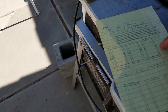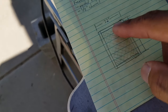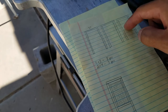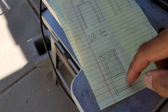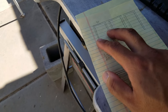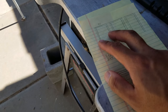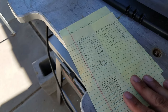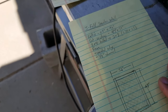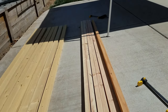Three two-by-fours will make the frames here which will encase the lattice, as you can see. Then I have the two-by-threes which will create the main frame of it, and I have it drawn out like that. As for the height, that has yet to be determined — I might go at most six feet. I never usually show you guys my sketches and notes, but this is what I normally do. So what I plan on doing is using these for the inner frame which will hold the lattice.